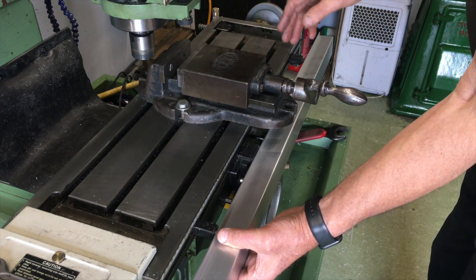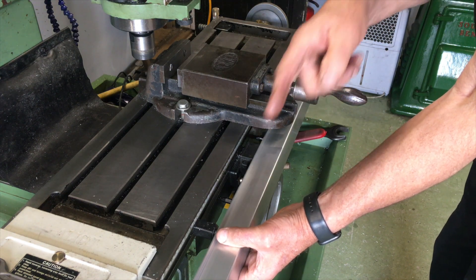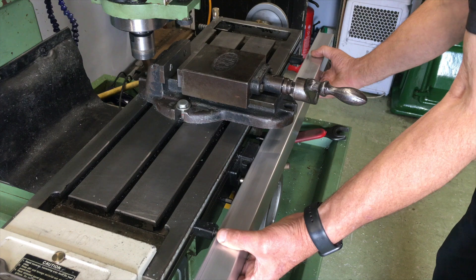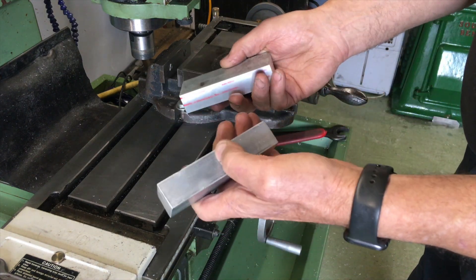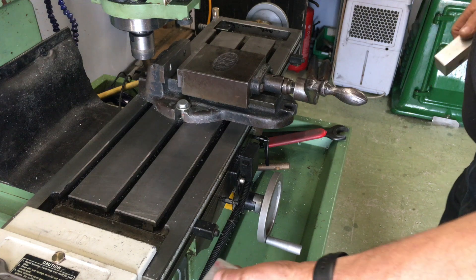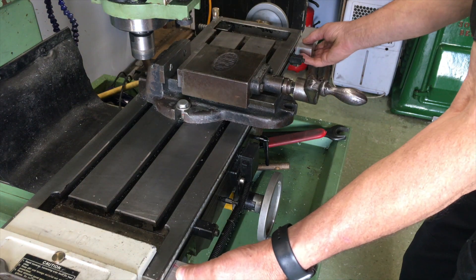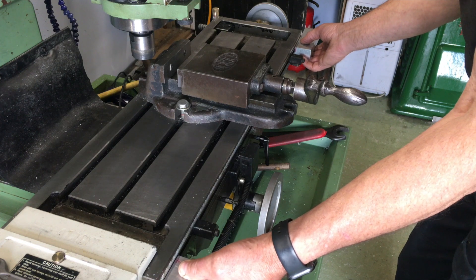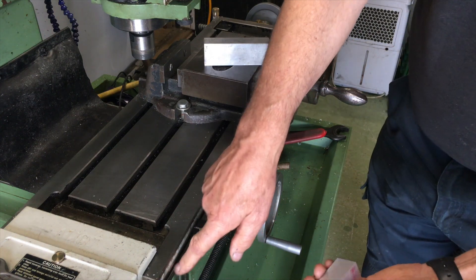So what are my options? Well it looks like I'll have to use more standoff spacers. As the scale is slightly wider than the table I can use the slots at each end to place these spacers. To do that I need two bits of aluminium. When machined they should sit over the slots utilising a shallow key to hold them in place, and they in turn will support the scale with enough room so as not to interfere with the traverse motor switch and allow plenty of room for adjustment.